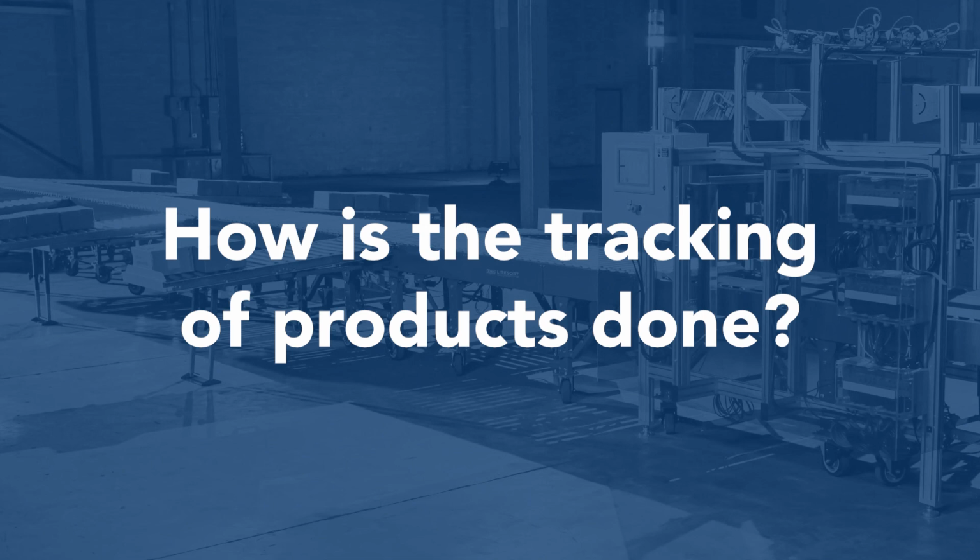Antonio Fernandez, how is the tracking of the products done? Time, photo eyes? It is based on the scan tunnel. It knows what the product is, how long it is, and everything, and it determines the position where that package is going to leave. So it's more of a pre-assigned location from the tunnel where that product is going to end and be diverted. There are no photo eyes; I think it's mostly done by time. So if that box leaves the tunnel and you're going to drop it on the third divert to the right, it will know that box has to leave once it hits that transfer pop-up divert table. So it's time.